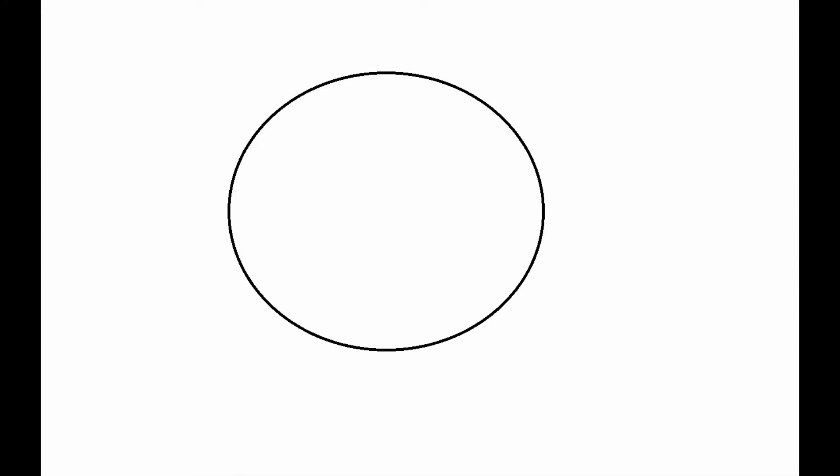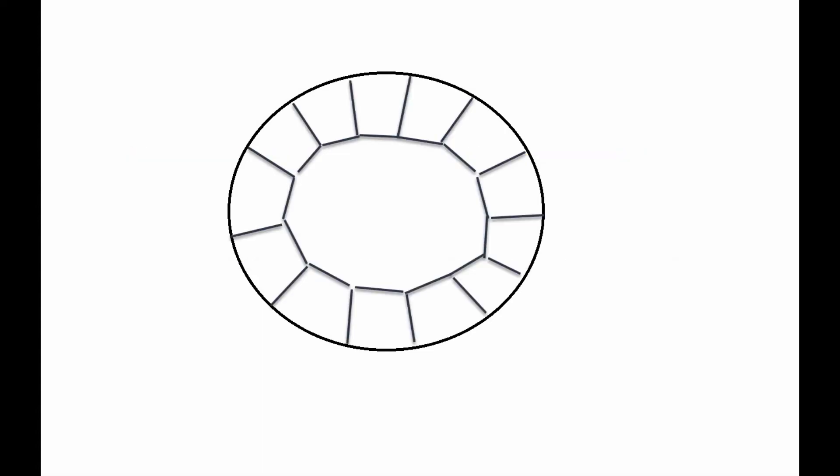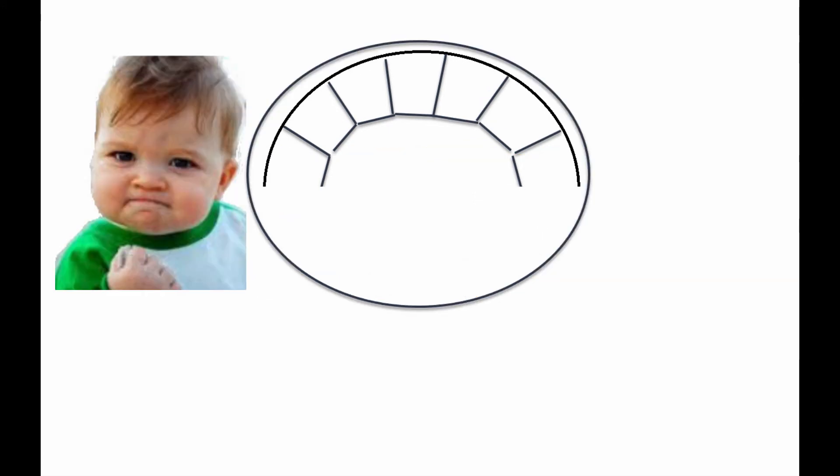Secondly, I would shape the outside of the box on a lathe. I would laminate wood together as before and shape a huge circle, probably 14 to 15 inches in diameter. I would take the circular stock and cut out sections in the middle, leaving two arched half-circle shapes. I would make the legs using segmented pieces, which I think would be really neat. These legs would be wider as well, perhaps two inches, so the dowels won't cause them to split so easily. They too would start out circular, but then I would cut them into sections later. I bet that matching a perfectly circular inside and outside curve on a lathe would be much easier.